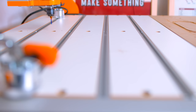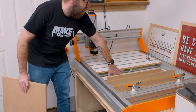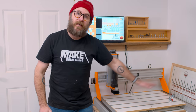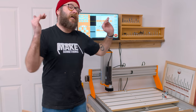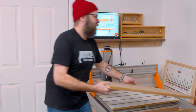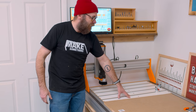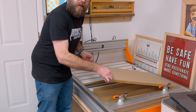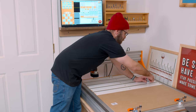One of the cool features about this Stepcraft CNC is it has two table heights. You have your normal table height, and then below it a second table height. So if you're milling something really tall that you can't get underneath, you can take the top table off and reconfigure it any way you want. When you order this machine, you can get the MDF top with T-slots or the aluminum top with T-track. I have the MDF top, and I cut a spoil board that drops right in.